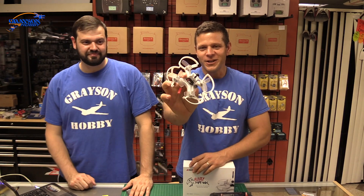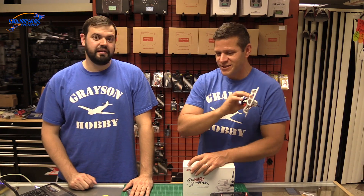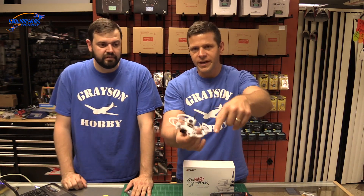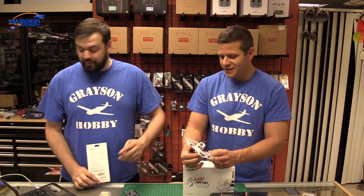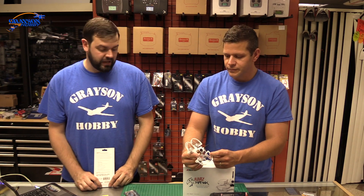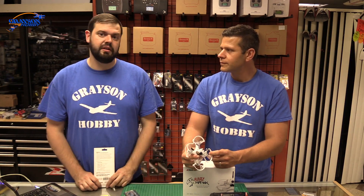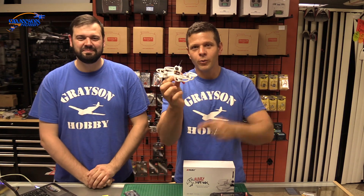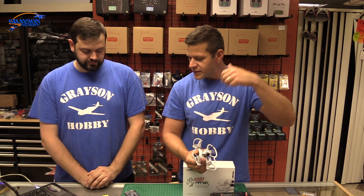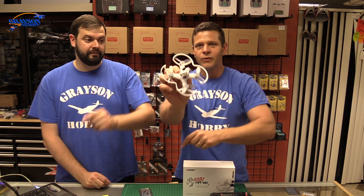There you have it — we showed you how to install and solder your receiver without taking the quad apart. I recommend taking the props off if you're going to solder in there, and don't cross them when putting them back or the quad will flip over. You need a basic soldering iron, flux — though you don't absolutely need it — 60/40 solder, and the shrink tube that actually comes with the receiver. The link below has the Baby Hawk with all three receiver options: FlySky, FrSky, and DSM2, plus batteries and everything else. Like, subscribe, and let us know what you think.